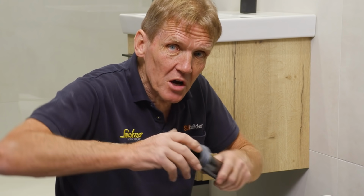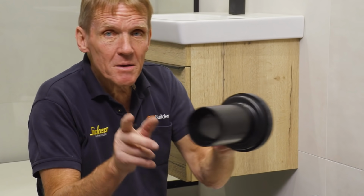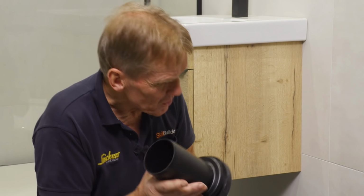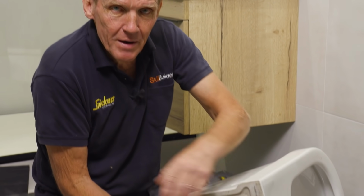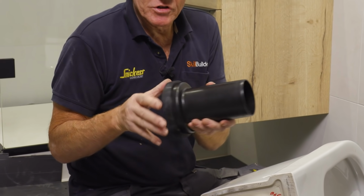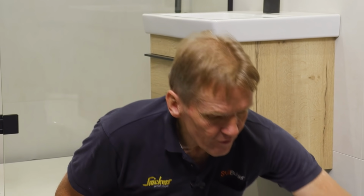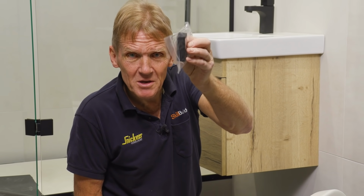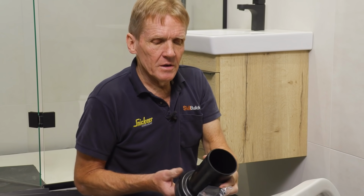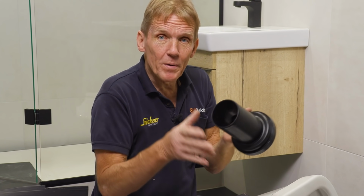And then when you tighten those bolts and the pan goes back against the wall, you know it's not pushing against that lug. That's all I'm saying. It's very, very important to do that. Same applies when you do this, but it's not quite so critical. But again, you just put it on there, mark it up, put it into the wall, mark it up, cut off the difference. Obviously chamfer it down, and put the silicone grease on. Very important. Comes in this little sponge, by the way. It's impregnated with silicone, so you haven't got to go looking for it. You haven't got to use fairy liquid or anything else. And that will be the perfect job. Honestly, you will get no problem if you do that.